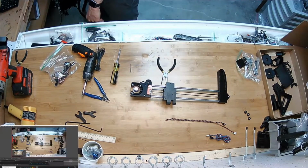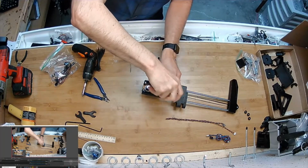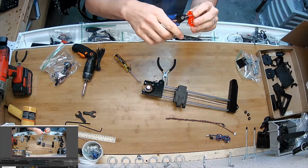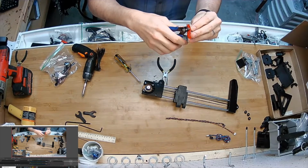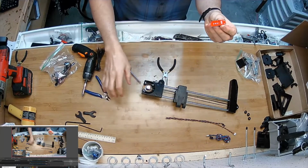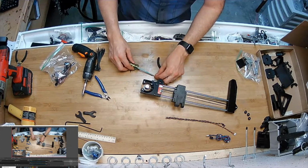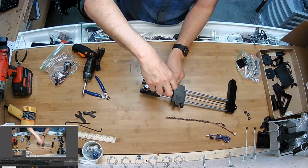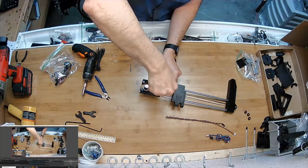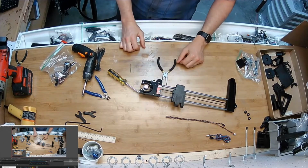What's next? So I was playing with my switch, and I decided, like I said, the commodity part, they're all a little different. The one I prototyped with had shorter leads on the bottom than this one does, so I'm going to cut these off on the bottom. Doesn't affect the electronic functionality, but it does affect the clearance down here. There, now it sits nicely without rocking. And I hate to have to do that, but it is what it is. Now a single screw locates it and secures it completely. That's all you need.